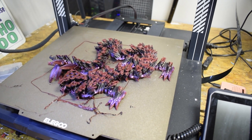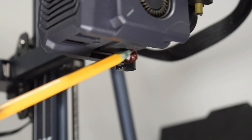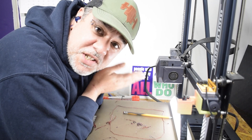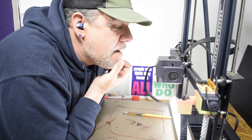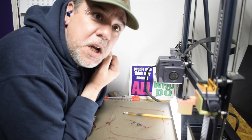As you can see, I kind of had a mess up last night. This right here is our problem — a giant glob that has been hardened on, because I turned off the printer. It was all my fault. I tried to make you go too fast. Elegoo has a speed recommendation of like 30 to 60 millimeters per second. I think this thing has a top speed maybe of like 120, maybe 150, before it really messes up. My son and I didn't want to wait the 28 hours for that. We took some shortcuts and it made a catastrophic failure.